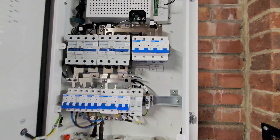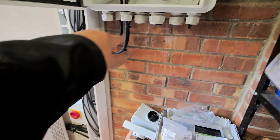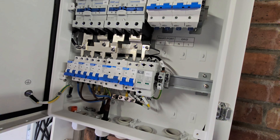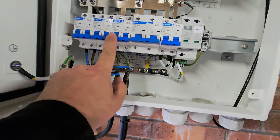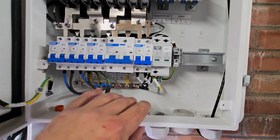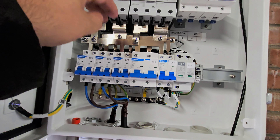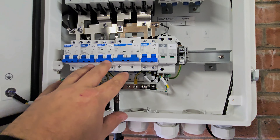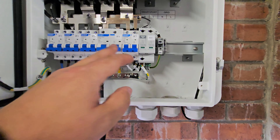That gives comms between the two products. You can bring a hardwired data connection in, which we're going to do onto the stack itself. The customer's just the other side of this wall with a nice Wi-Fi router so we've got good signal, but we're going to hardwire it anyway. The EV charger that we're taking off from the outside wall — we're wiring into one of the inverter ports here. The consumer unit wires off this set of busbars, so it's seen as load, and it'll be the same with one of these breakers. I'm going to swap this out for an RCBO, but that will still show as load on the system. The CTs will measure it correctly and we've got the right overcurrent protection.